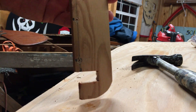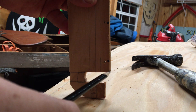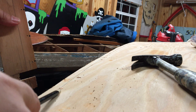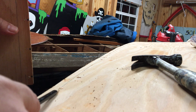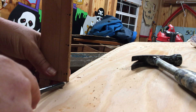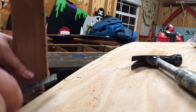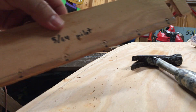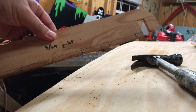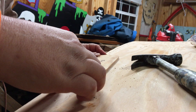We made this little jig so the bottom edge rides along the side of the boat. At the top it's inset about a quarter inch, because underneath there is a half-inch side panel. We set it there and came along and marked with a pencil all the way down, marking that quarter inch in so we knew where to put the nails. He also made little holes every two inches.